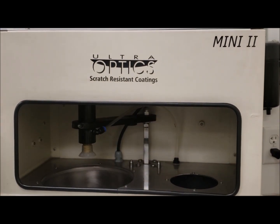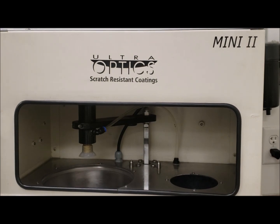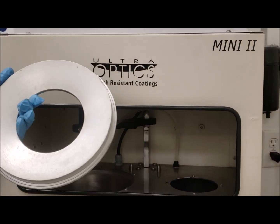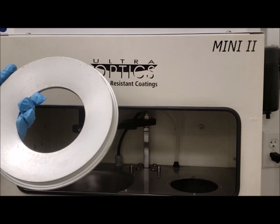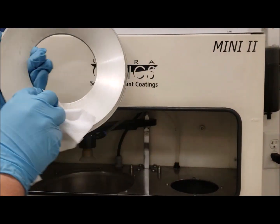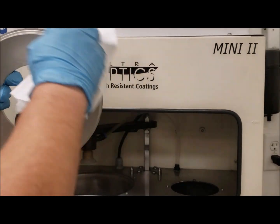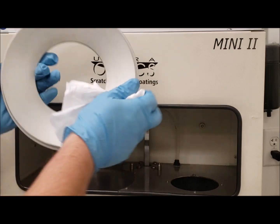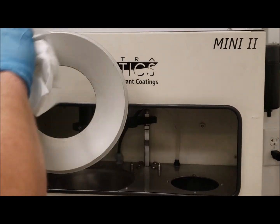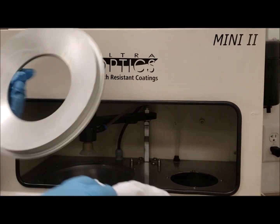Once you're satisfied with the cleanliness, double check that your air dryer nozzle is facing towards the sprayer nozzle. You also want to inspect your cover plate. It is a good idea to again use a liberal amount of IPA and wipe the underside of your bowl, as contaminants can build up on the underside — contaminants such as leftover polish and swarf. These types of things can cause damage and imperfect coats on your lenses. Replace the cover.